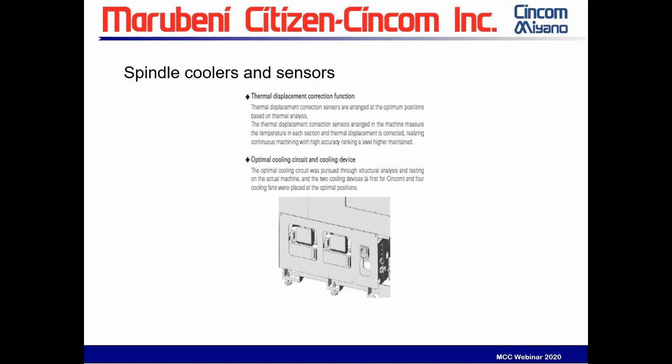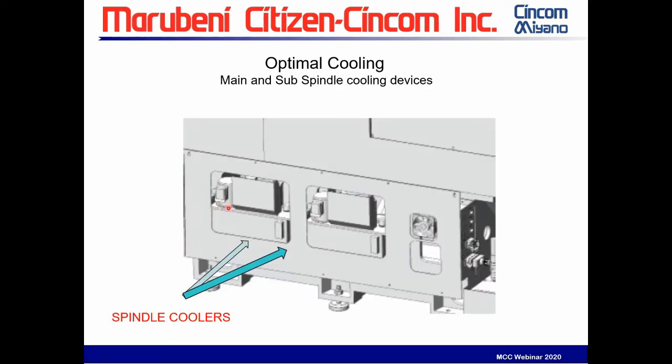Something else they've added is spindle coolers and sensors on the machine. There are thermal displacement correction sensors throughout the machine so that it automatically adjusts for any thermal growth. And then cooling devices have been added to the spindles to keep them cooler. There are 2 of them, 1 for the back and 1 for the main.